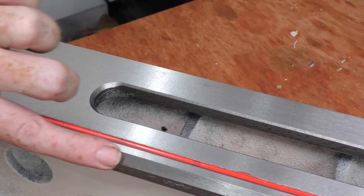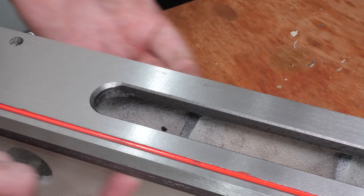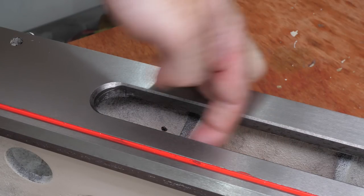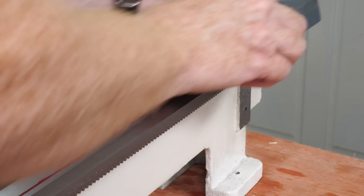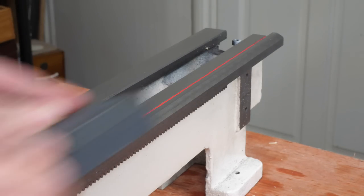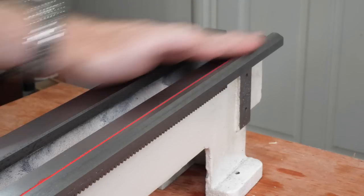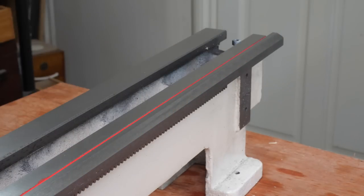The next problem with the bed are the burrs. All the ground faces have sharp edges, and it feels like there are burrs on every corner. These burrs can cause contact surfaces to wear, and are sharp enough to hurt if I rub against them. I need to make sure I don't damage the ground surfaces when removing the burrs, so I'm using a bench stone to abrade them smooth. For each edge I run the stone along at different angles to catch every part of the burr, but make sure the stone doesn't come into contact with the flat surfaces. Once the burr's gone, I smooth the corner with the finer grit side of the stone.